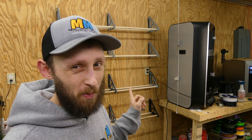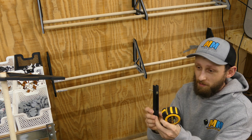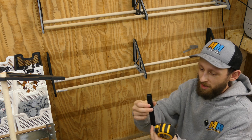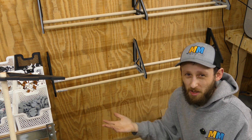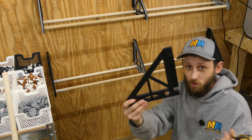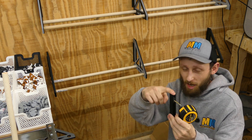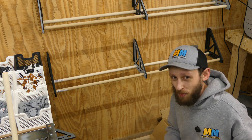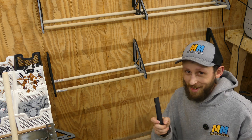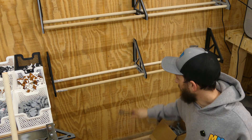With the help of my brothers last week, I got those installed. I didn't film any of it just to get it done, but I do want to get that last one put up right now. What they look like is this right here — they get mounted against the wall like that. There's a slot on either side, it's kind of a 45 degree — we'll call it a French cleat. This guy goes into there, slots into place, and you're good to go. But because you're not measuring from the top of this, and we're measuring from the top of this, all of these have to be lined up together. The easiest way I found is to install one and then take a measurement from the floor or ceiling, depending on how you're installing them, and mark it on the wall.